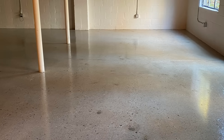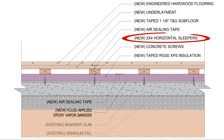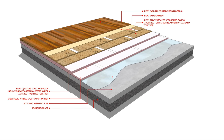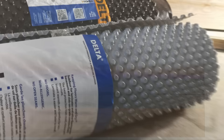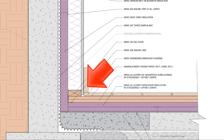If we're using a fluid-applied epoxy to provide our capillary break and moisture control in the slab, we can simply install the rigid insulation directly above the slab with staggered and offset joints, which will provide the benefits of a thermal break and a secondary capillary break in the event that moisture happens to find a path through the epoxy. We can either install sleepers above the rigid insulation layers and a single layer of subflooring — a more traditional strategy — or we can install two layers of subflooring with staggered and offset joints that are glued and fastened together directly on top of the rigid insulation, where the subfloor is essentially floating. If you want a more compact buildup, the floating floor tends to work best, and you don't have to fuss around with fastening the sleepers to the concrete slab. If you're installing a dimple mat over the existing slab, you pretty much have to use the floating floor strategy, as fasteners through the sleepers will puncture the dimple mat and compromise its function of vapor pressure equalization. The floating floor also allows you to install non-load bearing partitions directly over the subfloor, and the rigid foam and dimple mat have substantial compressive strength to support partitions.